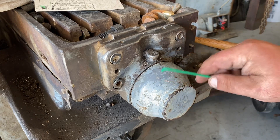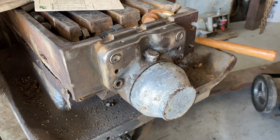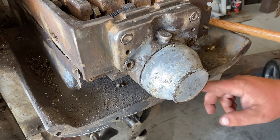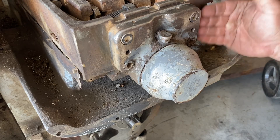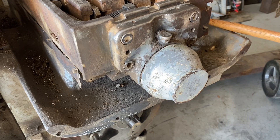So what I'm going to do today is take this cover off, maybe end up taking this guy off. Let's see what it would take to get a power feed hooked to it. Now another limiting factor — you see this lip right here? The drive is flush here. I ran this back until it's pretty much flush with that. That still gives me a good amount of travel, because 99% of what this machine is going to be doing is cutting keyways. Most of the keyways I cut don't get much longer than 6 inches.